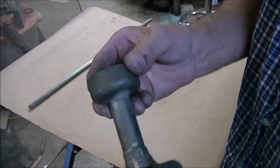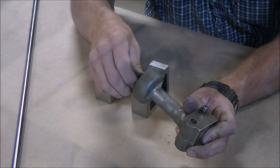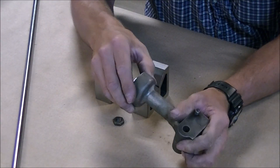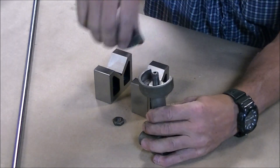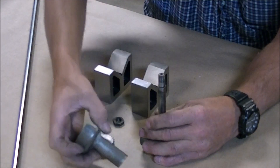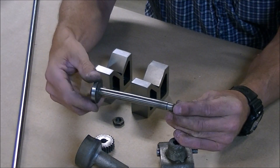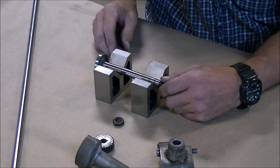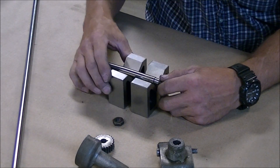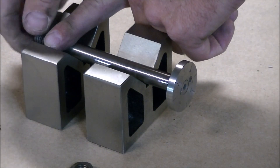So let's take it apart and see what's wrong with it. Taking it apart, I had a suspicion that the damage that broke it had also bent the shaft. There's a little gear that runs in the lead screw and then the shaft with the dial on the end. I got the V-blocks out because I already had a suspicion something was wrong there. As you can see, the shaft has been bent pretty seriously.